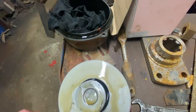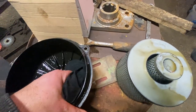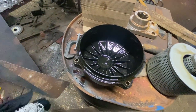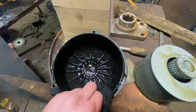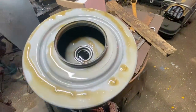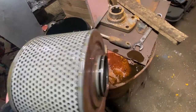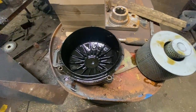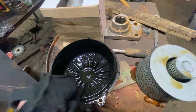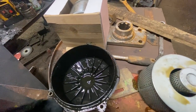I'll show you one of the filters here. This is our suction filter — this is the old suction filter — and this is the hose that sits into it. Anyone that ever asks me about funny transmission codes, I always say: have you serviced the tractor lately? Because you can get very strange things happening if you don't seat this filter in properly. So it's vitally important this filter is put in correctly. Thankfully, this filter is absolutely spotless — no contamination in the oil whatsoever, no bits of steel or anything, which is a good sign. But it's always a concern when you go to change filters — you don't know what you're going to be met with.